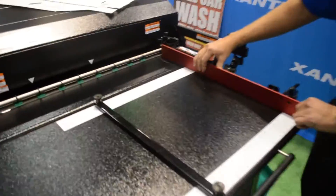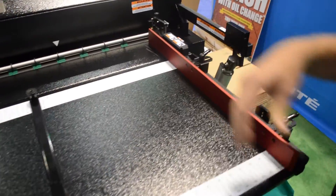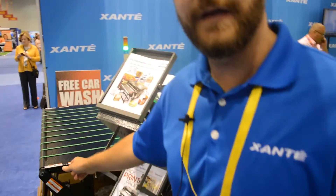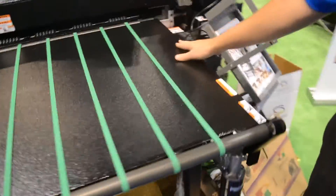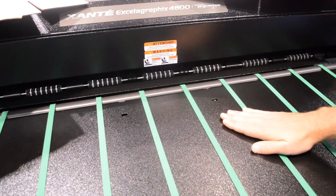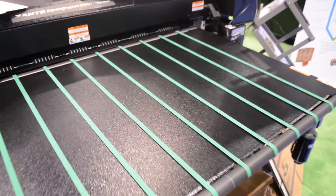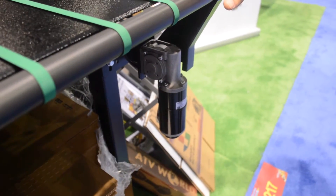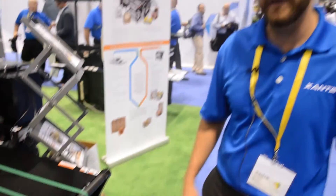We have a dedicated rigid side guide for a 48-inch sheet. We also extended the exit table — it can now accept a 48-inch sheet. We changed the table and made it a standalone table; it works based off of sensors. As the sheet goes over the sensors, the belts automatically move. We put a more industrial exit conveyor motor. The reason we made this conveyor standalone is you can now have two or three multiple conveyors back-to-back for doing longer sheets, so you can run a four-by-eight sheet through the machine.